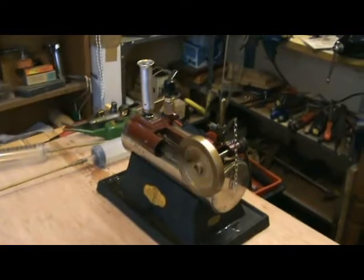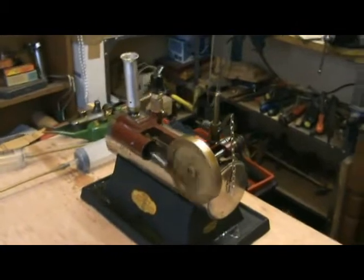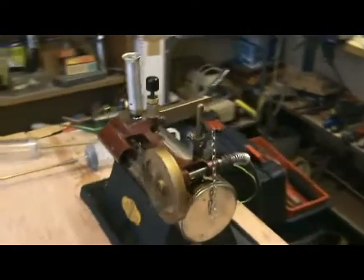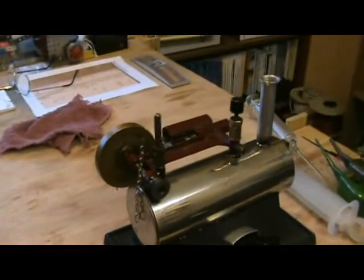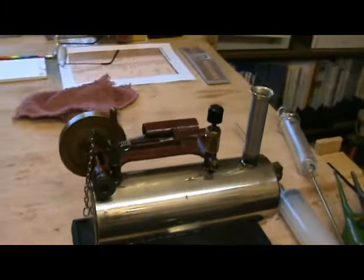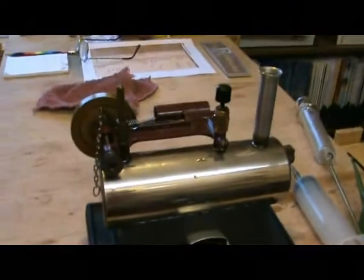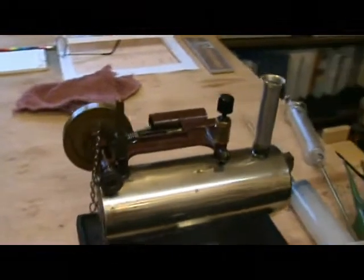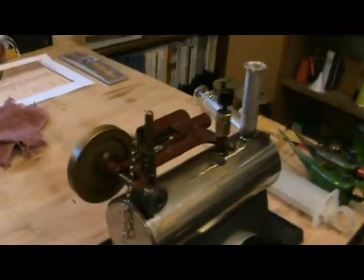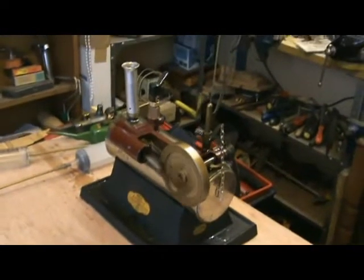We have success with the index. Having failed miserably with using PTFE for insulation in the heating element, I've replaced all the PTFE with mica sheets and ceramic beads on the wires, and it all seems to work ok now.